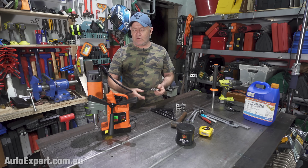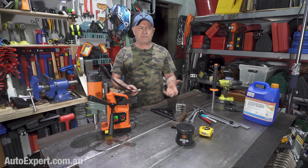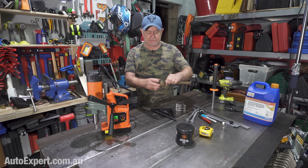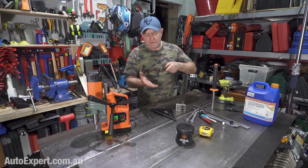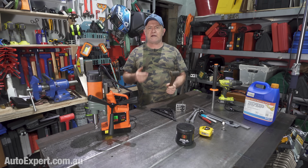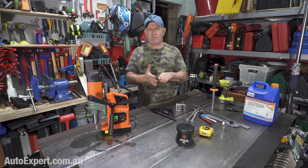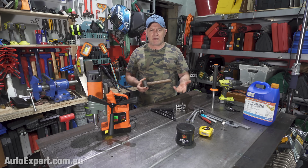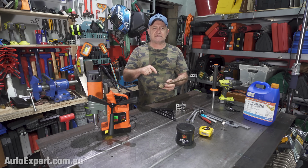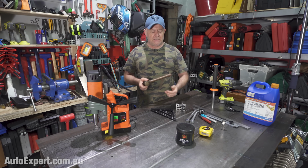And these things are almost better than a pedestal drill press, right? Because a pedestal drill press is really good if you're working on small jobs about this big or maybe slightly bigger. You can clamp them in the vise and drill very precisely and line it up. And you can also productionize your workflow a bit if you use the vise bolted to the table as a kind of reference surface. Then you won't have to mark out if you're doing 100 different things that all have to have exactly the same hole in the same location. You can just do it like process work because you've got your reference surfaces.